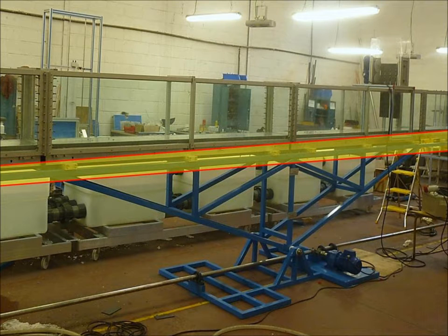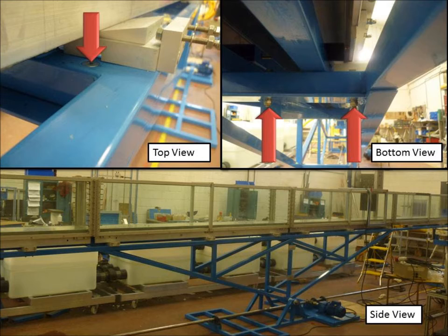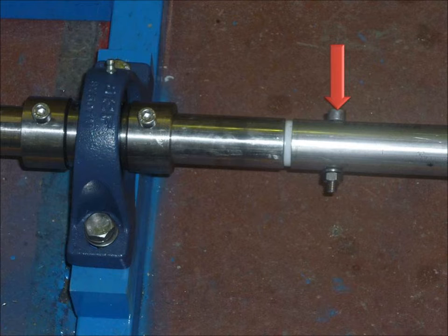Next, mount the top of the channel support to the middle section using the hex bolts provided. There are three of these connections in each of the four areas. Then assemble the sides of the frame to the channel supports on the ends using the shaft, washers, and bolts. Insert the bolts to connect the sections of the shaft. This is the shaft connected to the motor at the bottom of the structure. When this shaft turns, the angle of the channel is changed by the use of the gearbox.